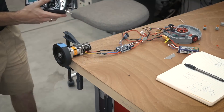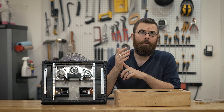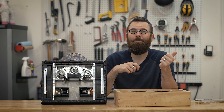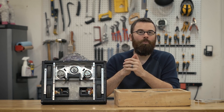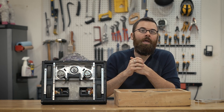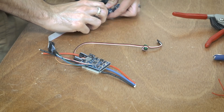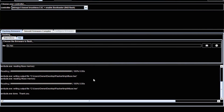As I mentioned in my previous video on electronics, I was using an 80-amp ESC. I ended up with that ESC for a number of reasons. First, it was one I could reprogram with SimonK firmware, which was necessary to get forward and backwards drive. Second, I initially did some testing with a 50-amp and a 60-amp — I very quickly blew up the 50-amp and eventually blew up the 60-amp too. Using telemetry, I found out I was drawing about 55 amps peak under hard acceleration with everything maxed out. So I ended up going with the 80-amp ESC. If you saw my previous video on how to reprogram the ESCs, check that out — it covers all the details on how I reprogrammed it to accept the SimonK firmware to tweak the drive settings.